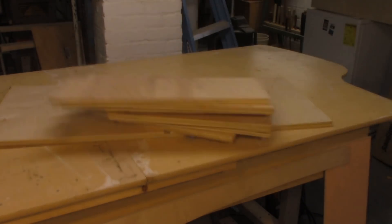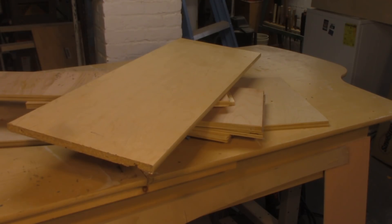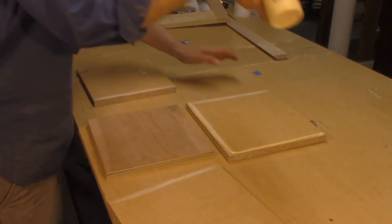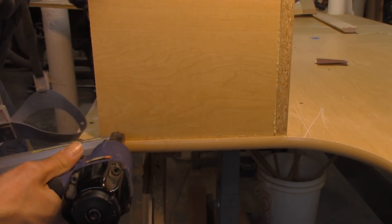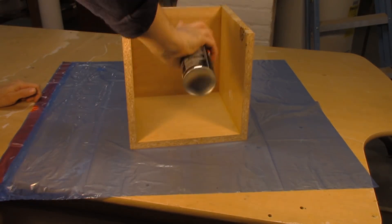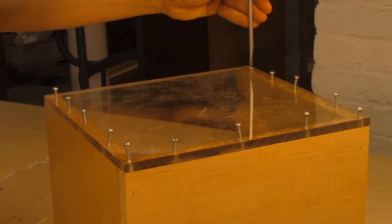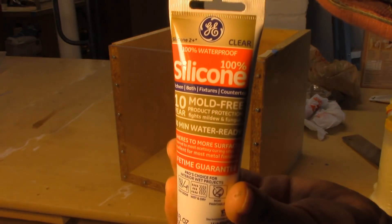You're supposed to use nothing but a sheet of plywood for this build. This is about half a sheet of plywood I had left over, and this here is a big chunk of particle board. I'm ripping the particle board, cross-cutting it into small pieces and then I'm going to make a box out of it. I have an idea to make a bowl that combines broken plywood and colored resin together and I need a container to hold all of that. I glue the sides of the box together and then pin them with my brad nailer. Since I'm going to be using resin, I really don't want it to stick to the inside and I don't want it to leak, so I'm painting the entire interior with clear lacquer to try to waterproof it. I'm also putting on this piece of clear Lexan so that it's better for filming and so I can see what's going on while I'm pouring the resin.